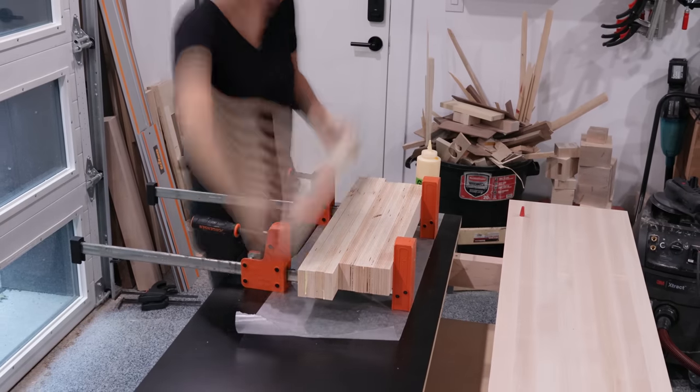All the dog holes get a slight chamfer with the router. Everything gets a final sanding and all edges are eased over. Lots of people in the base video thought I wasn't going to make this bench mobile — of course I'm making it mobile. I bought these casters way back in April when I was planning this bench and the installation was pretty simple, especially with the drilling templates they provided and even simpler with a spacer block I made based off of their template. It moves around super easy — not a bad Amazon find.